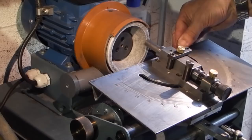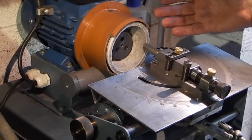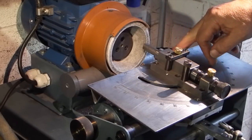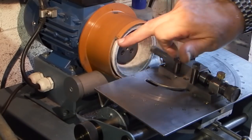The idea is you're not lifting the table up with the wheel. When you're taking a cut on a tool you do the same thing — you're pressing the table down so it gets a firm base and you get a steady and fine cut. I've got some suction coming through around the side of this wheel.